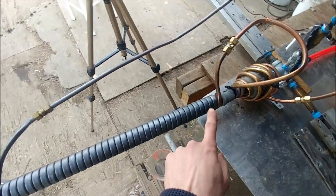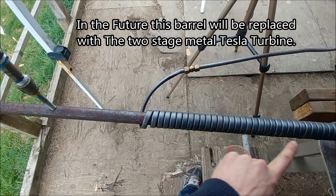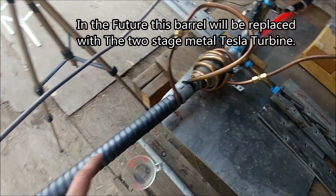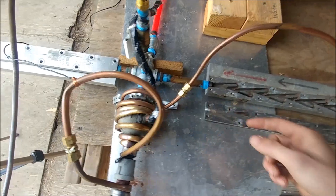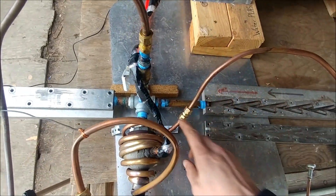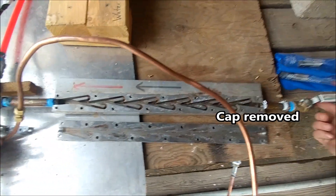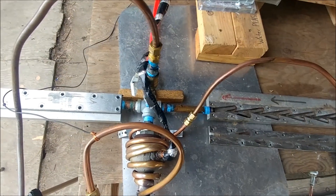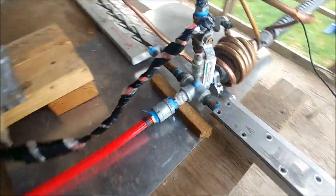This barrel right here adds a little bit of vacuum as everything is burned and accelerated out the front. There's a very low pressure inside the chamber, but when the explosion happens it doesn't allow the air to exit and come out the Tesla valve. Regular pulse jets have physical valves, and that limits their frequency.